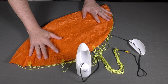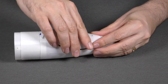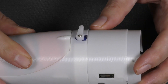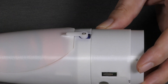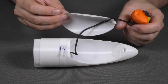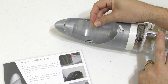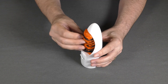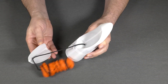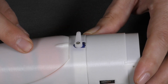Though it looks like there isn't a lot of space inside the nose cone for the parachute, we can still fit a 70 centimeter diameter parachute in there. The parachute is held in place by this 3D printed door. It has a tab at the top to hold it in place and at the bottom it just fits right here. The servo motor holds that in place until it's time to release it. Having the servo horn exposed like this means it's very easy to load the parachute without even turning on the unit. There's a little notch at the bottom of the door that keeps it aligned with the nose cone so it can't slip sideways. The door itself is attached to the shock cord so we don't lose it during deployment. The Phoenix deployment mechanism used a spring to get the parachute clear but to simplify the design we omitted this altogether. The parachute just has nothing to catch on in the nose cone so it's very easy for it to fall out into the airstream. The door, once released, really acts as a small drogue to help the parachute clear. Instead of a spring we're actually using the parachute itself to help pop the door out — it doesn't need to move by much, just for the top tab to fall out.